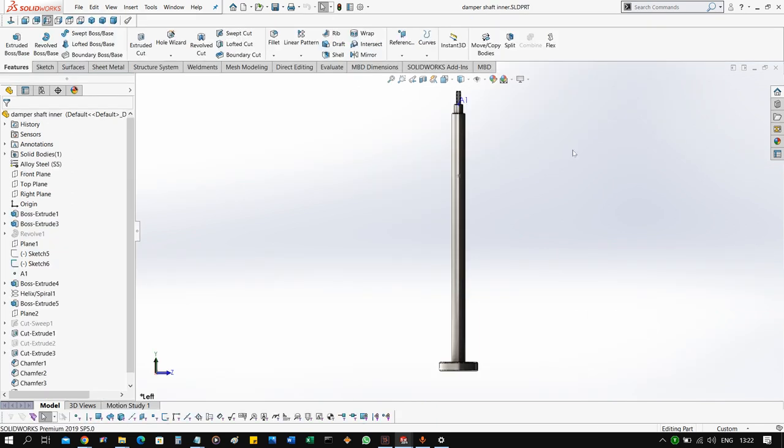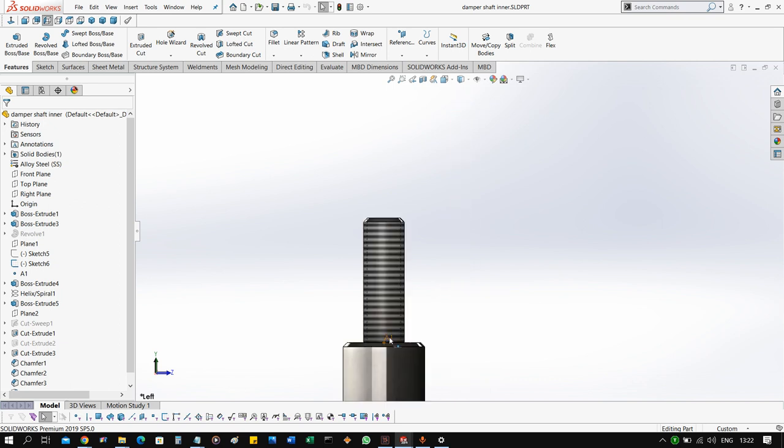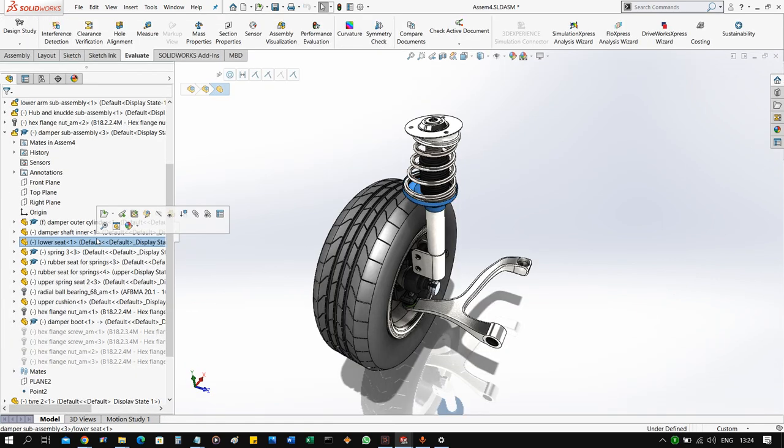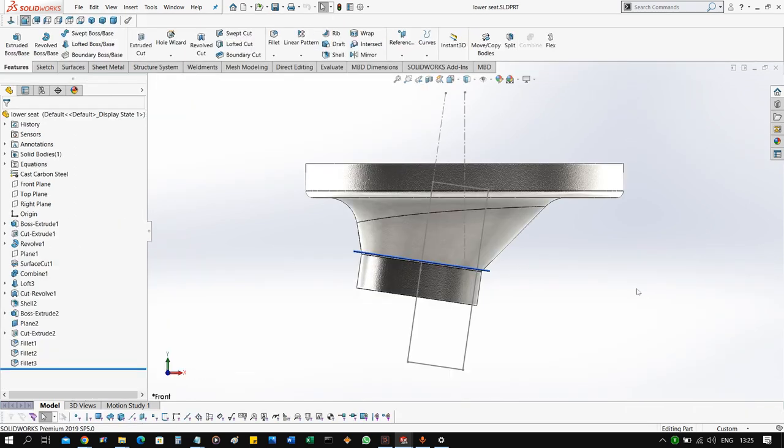Now you finish the strut, then we move on to design the piston which moves inside the cylinder. The piston can be of any shape and length, whatever meets your requirements. Then you insert the piston and the entire cylinder that moves up and down, with threads on the top where the nut will be fastened inside the hood of your car. First make a cylinder, insert the piston, then insert the tiny shaft on which the nut will be fastened, add another cut extrude on the top, and then finally chamfer the edges.